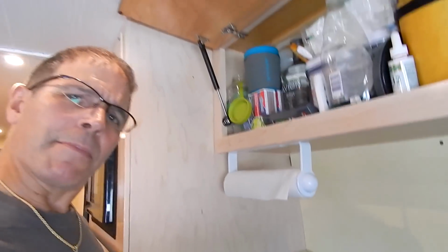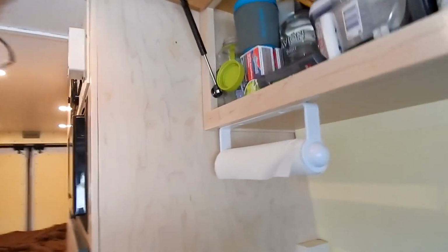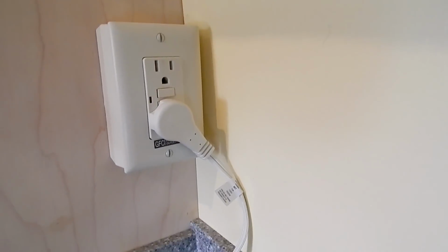So every time you cut the template, you're losing 3/4 of an inch. But I'm going to tell you what happens. Look at that line. It's almost perfect. Here's another secret, another reason why you use 1/4-inch plywood for your template: you could get a rasp file and file it and make it perfect before you cut your panels out of that.